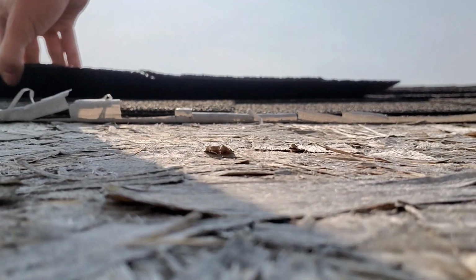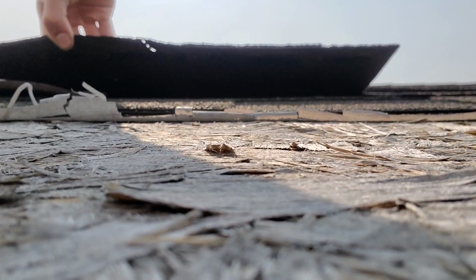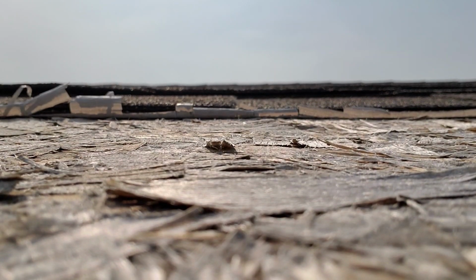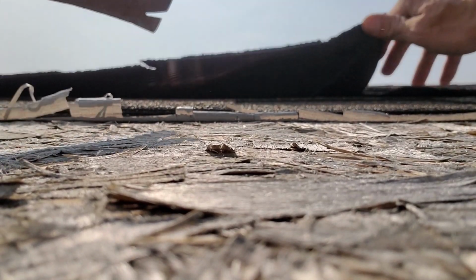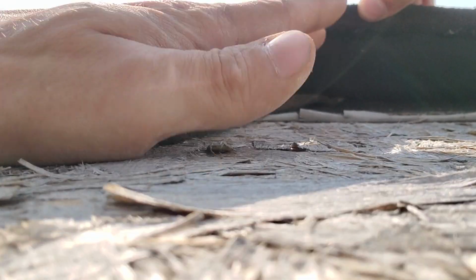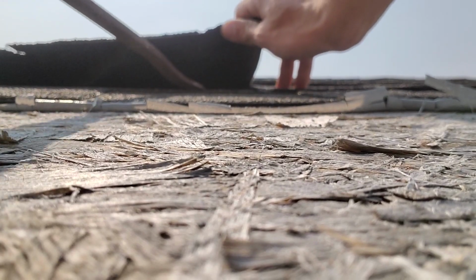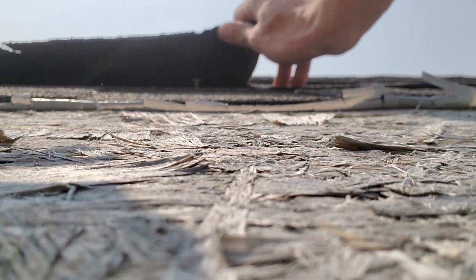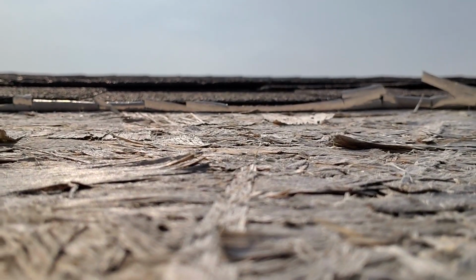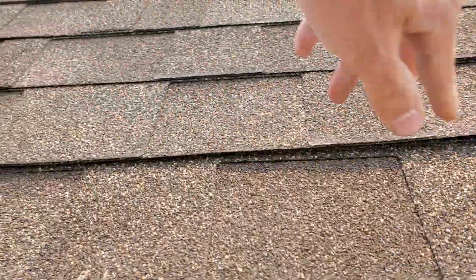Here's a little bit better review for you guys. I'm going to start underneath to try and get it started, and then you'll work it the rest of the way out. And you'll want to go a couple of rows higher with your nails. You'll know when it's loose because you'll be able to pull the shingle out for your patch job, because there's 2 rows of nails, and I'll go into more on that later on in the video. But you want to make sure you get all those nails out to be able to pull the busted ones out. As you can see here, got all the bad shingles removed, pulled up.